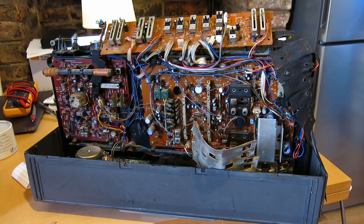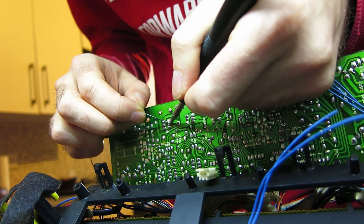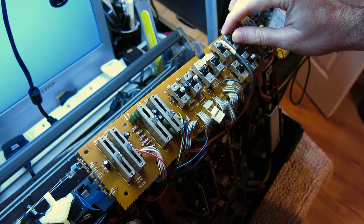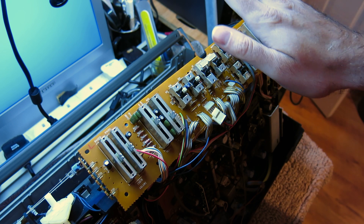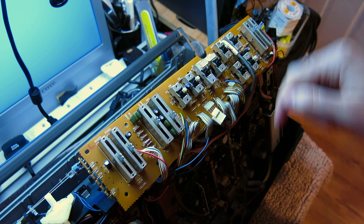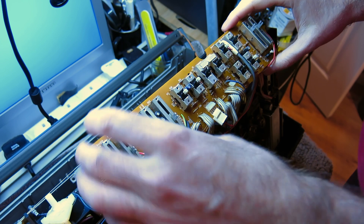Here's the really dirty spares machine I've stolen the switch from. We've nicked this switch out of the donor unit. You have to be careful to get it on the right way because the toggle has to push in a specific direction. The screen print on the board is actually upside down so be wary of that — don't follow the screen print thinking you've got to orient it that way. So that's been soldered in. I'm going to reconnect the plugs, get the screws in, see if it works, and get the shielding back on.